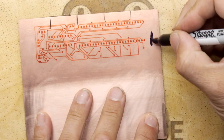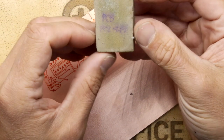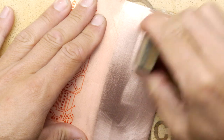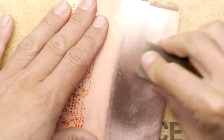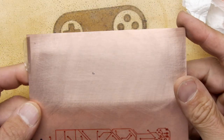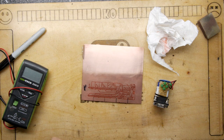I'm going to be freestyling it with just a Sharpie. You'll notice this piece of PCB is quite shiny because I've got something that looks a bit like an eraser — it says PCB polish on it — but it's basically a piece of emery. We don't need the whole board, but I'm going to buff it up anyway. Try a few different directions to make sure you've got uniform scratches all over it, then take a piece of regular kitchen roll, give it a buff, and you can see you'll get a nice shiny finish.